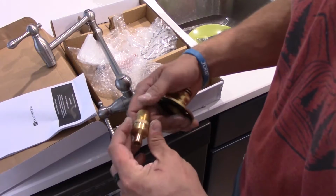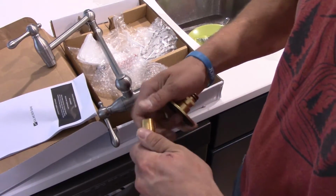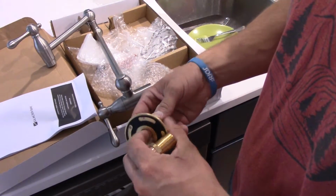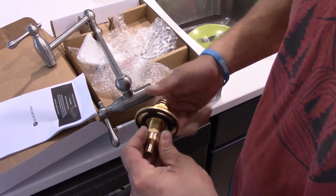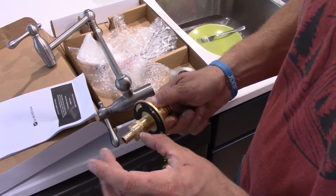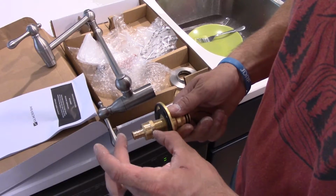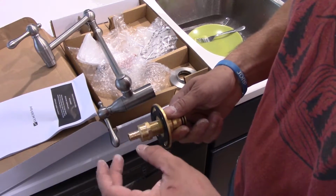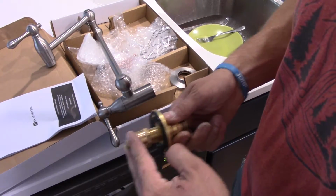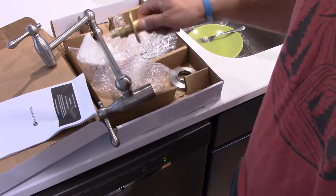So what I'm going to do is just use a crimp to PEX fitting with a short pipe nipple, and this is 1/2 inch. I'll tape and put dope on this. I'll thread it in. This will be crimped to my PEX, and I'll just leave enough room in the wall, it's a 2x4 depth wall, so that my PEX is stuck out. So when I'm ready and the tile's done and grouted, I can shut the water off, cut the pipe, crimp it here, slide this back, and then attach it to my stud on the left side.